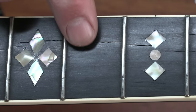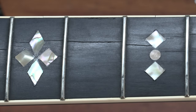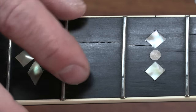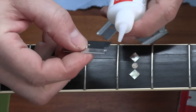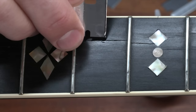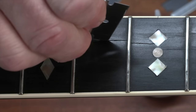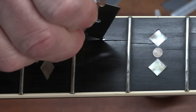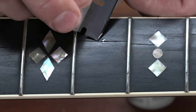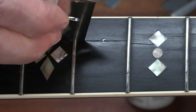We're going to do this crack right here to begin with. Normally I would just start at one end of the board and work my way down, but this one shows up really good on camera and you'll get a good visual of what I do to fill this crack. We're going to add a few drops onto our razor blade and just get the tip of our blade right into this crack. I'm not trying to fill this entire crack — I just want to get the bottom of it kind of sealed up here. And the glue works itself right where we need it.